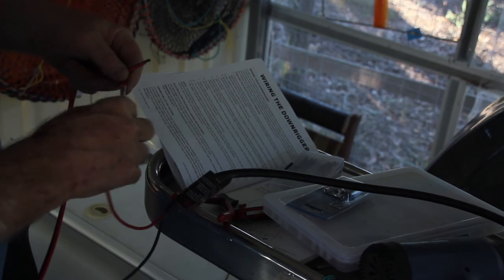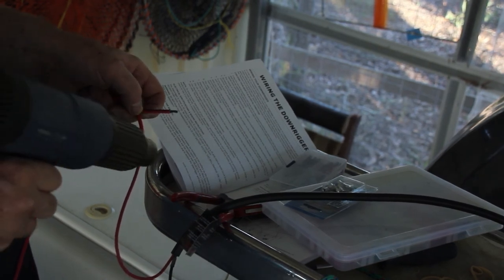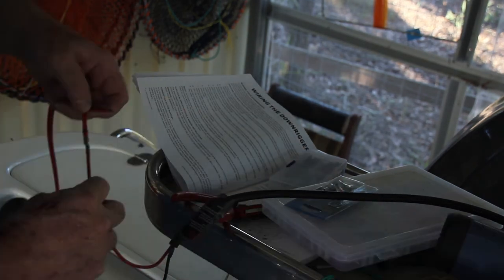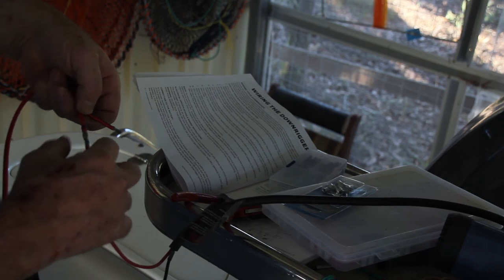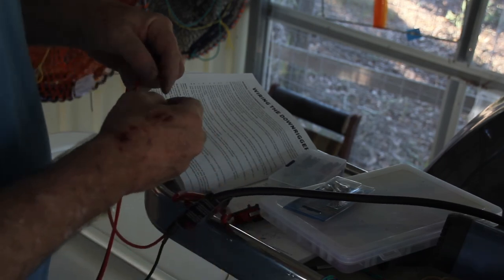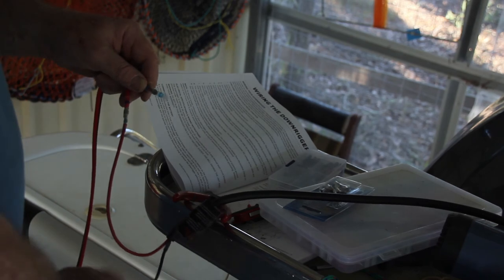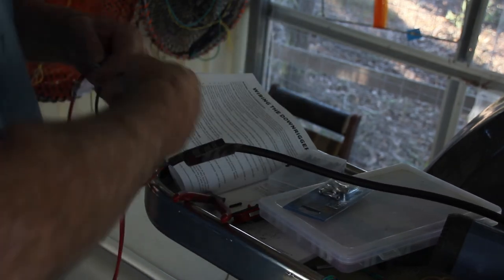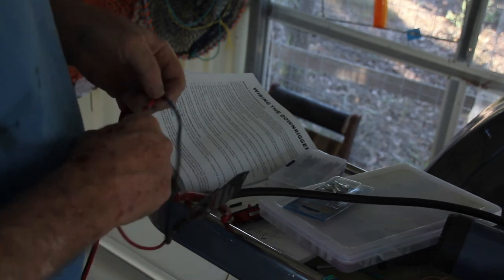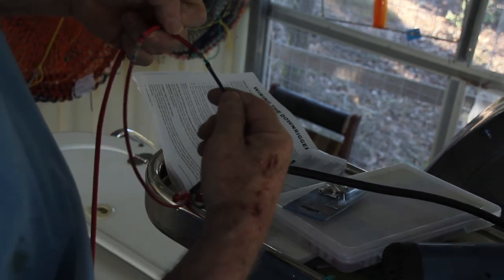I've just got to join a bit onto the plug that came with it. I've got some slightly heavier wire because it's always better to go heavier than lighter. And I've got these heat shrink solder joins — as you heat them the solder melts, joins the wires, and then they shrink down onto the insulation as well. You can get them off eBay; they're pretty cheap and they're just excellent for joining wires in marine applications — any application really, car or whatever. I don't think they're 240-volt rated, but anything short of that they're excellent. The wires push in together so there's lots of overlap and contact, then just heat it up. Keep your finger out of the way because it does get pretty hot.